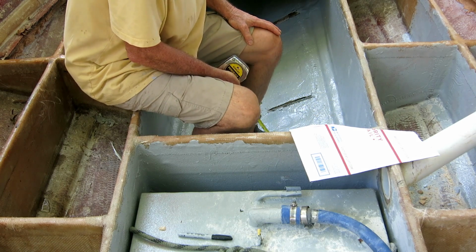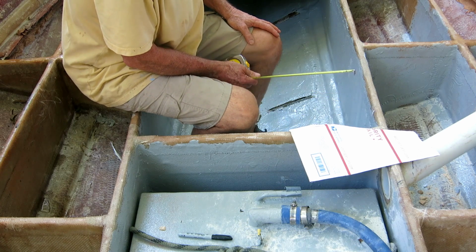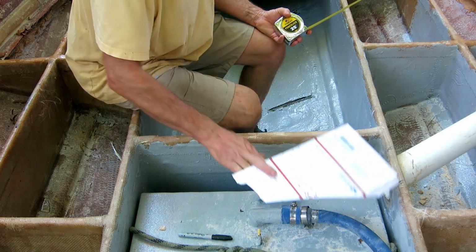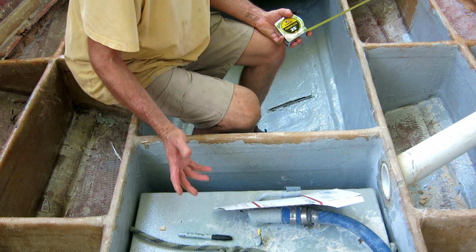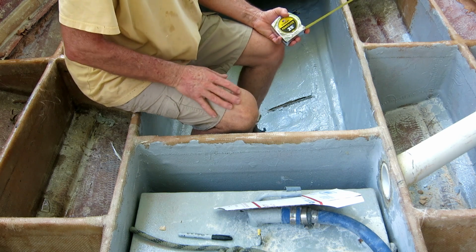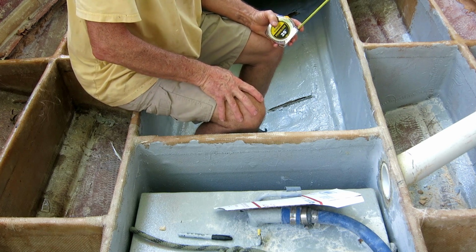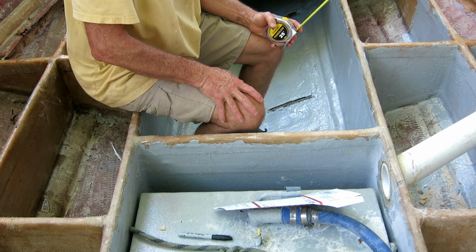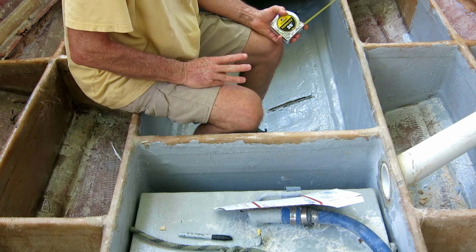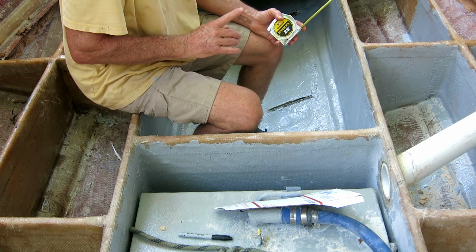a sump pump, a bilge pump under the batteries, make a shelf, and I can easily hold four group 27 batteries. I need one battery for house batteries. That's for lights, for radio, just for having on during the day. It's separate from the outboard battery, so you always know the thing's going to start at the end of the day. And if I get a big trolling motor, that's 36 volts, so that's 3 batteries. So probably won't get 4 batteries right away, but I want to have a place to put them.